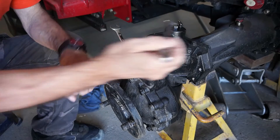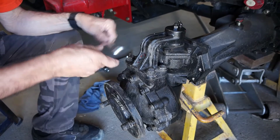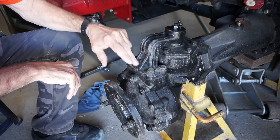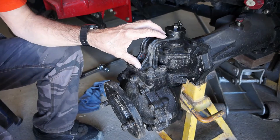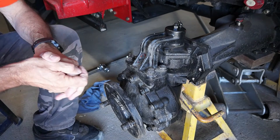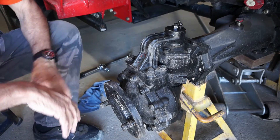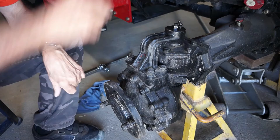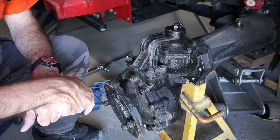But not take it completely off. Then you've got these four bolts here and I see 18 mil. That way we're going to take off the steering knuckle - in the parts book from Dong Feng it's called a linking arm, but we'll call it a steering knuckle today. We're also going to put a jack right underneath the final drive here, separate to this yellow stand, because when we take this off something's going to possibly fall through - could be the kingpin or something - so we need the jack there to support it.